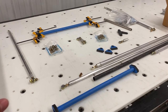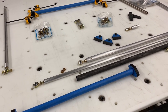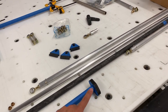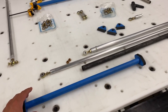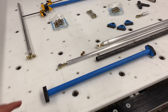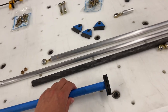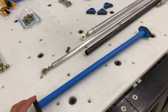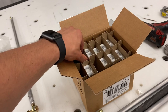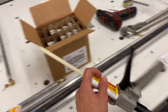Here's what we're working with. I have a bunch of components in the control system laid on the router table here and I'm gonna be doing some bonding and fabrication steps in the build process. The torque tube, which is made out of carbon fiber, is going to get some bell cranks bonded on to the end. I mask off all the bond area to keep it clean — my pro tip: mask off your bond area. I got a fresh batch of E120 adhesive in the mail and that's what we're gonna be using for the job.